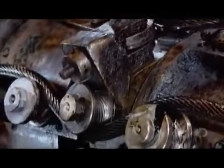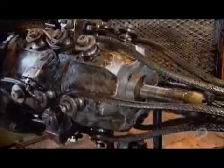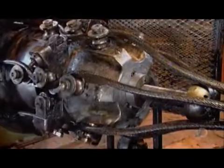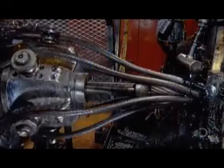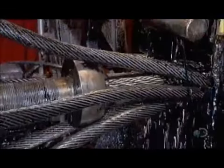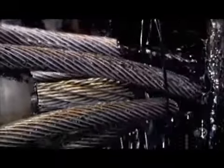They make this particular rope from six wire strands. Before the strands converge in the die, rollers pre-shape them into a corkscrew-like form. The strands then enter the die, twisting together over a core, which is itself a small steel wire rope. A core at the center of the cable provides additional strength.